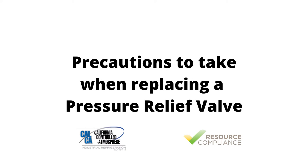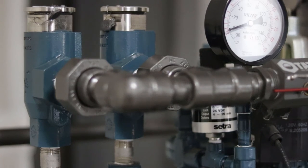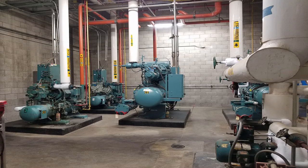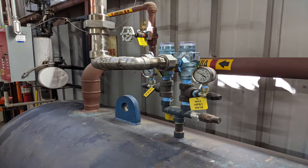The following are important precautionary measures to take when replacing a pressure relief valve. Never expose your face or body to a connected relief valve exit or piping. Make sure the relief valve setting and capacity meet the requirements per system design in accordance with good engineering practices. Install the relief valve on the equipment at a location above the liquid refrigerant level. Do not install shut-off valves in line with relief valves. Install valves in locations where they will not be damaged by moving equipment, such as lift trucks. Install valves in a manner that enables them to be replaced.